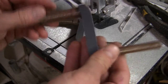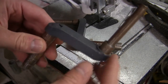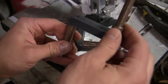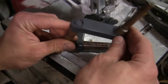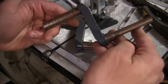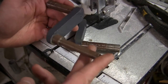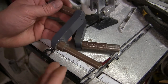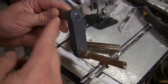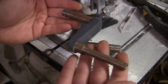The construction of the parts is as follows: the two axles are made out of steel, while the swing arm body itself is made out of billet CNC'd aluminum. It is important to note that this is the revised swing arm. On the original first batch of Armortech Tiger Is, the swing arm design was that of an all-cast one-piece unit. This design was very true to the real Tiger; however, it was discovered shortly after the first batch was built that the swing arms were a weak point and were prone to cracking.